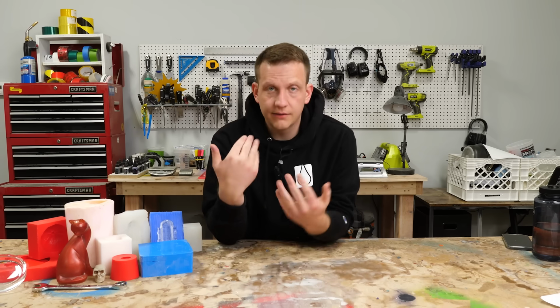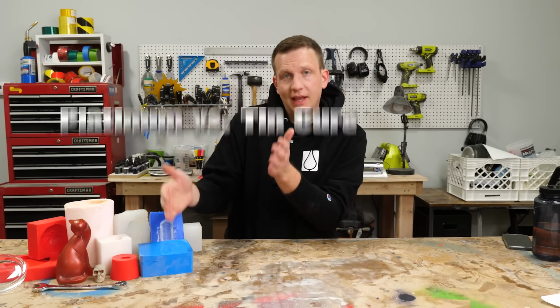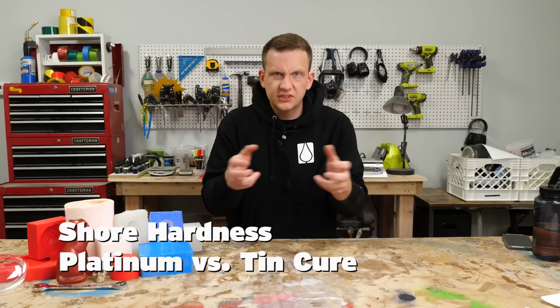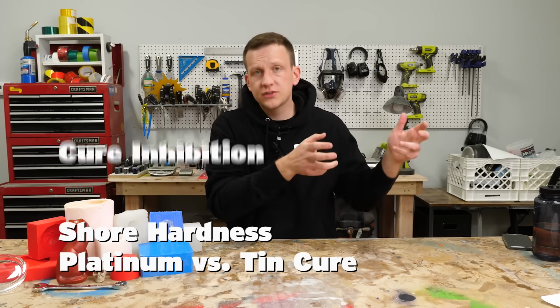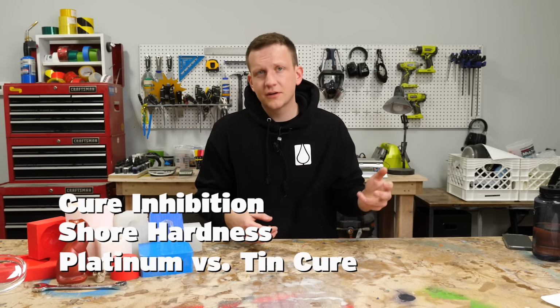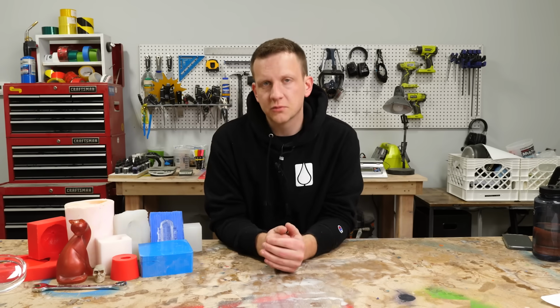But we do have to align on 3 terms that'll make sure that we have shared language for the rest of this video. Platinum versus tin cure, that's a type of silicone. Shore hardness, that's how stiff the actual silicone is. And then also cure inhibition, that's something that makes it so it never actually cures. Going through those 3 terms real quick will help us make sure we're making a good call.